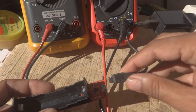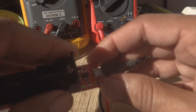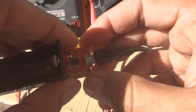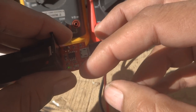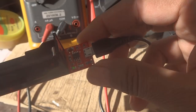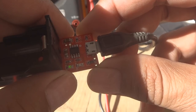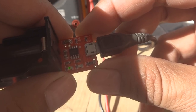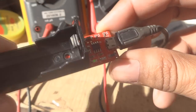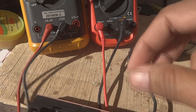Now I'm putting it in the circuit, supplying power from my laptop charger. You can see the green LED has come on — there is no battery inserted, so it will switch to red after two or three seconds, then back to green. It may be hard to notice in the sunlight where I'm shooting this video.